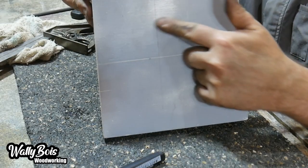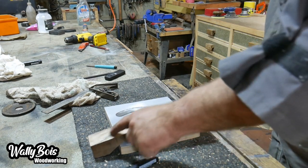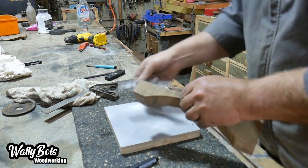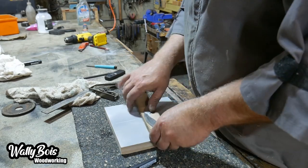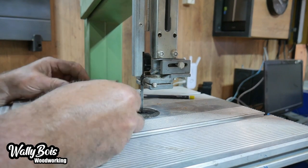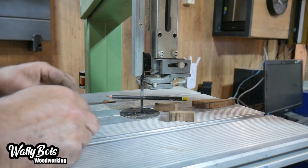It's not very comfortable on the hand as it is, so we're going to make a handle from a piece of walnut — lovely timber. We mark out two handles onto the walnut because we're going to sandwich the marking knife between two pieces of wood, which will make it really comfortable. It will be a little bit lumpy at first, so we'll have to do something about that.